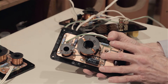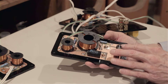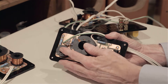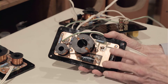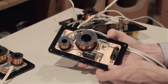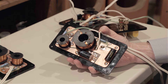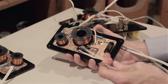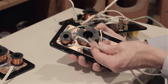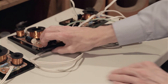The more the crossover parts, the steeper the slope, which would be good. But on the other hand, the more parts in the crossover, the more components you introduce into the signal path going to the driver, and this is not a good place to do that. That's why I'm a fan of electronic crossovers - we do that before the amplifier output to the speaker end, and have no crossover parts out there. But if you're going to do this passive crossover approach, you're going to make a compromise. Second order is a nice choice - you get relatively steep slopes but not so many components. This is a 180-degree out-of-phase network, so the tweeter and mid-range are coming out 180 degrees out of phase, and they did in fact reverse the polarity of the tweeter. These guys knew what they're doing. They did it right. It's impressive.